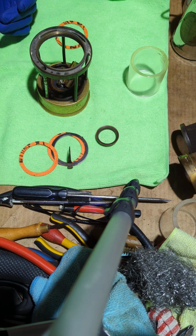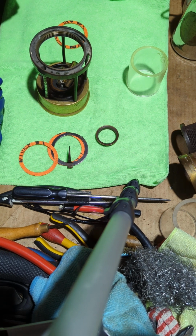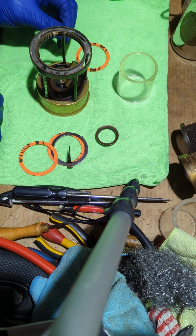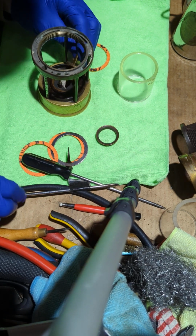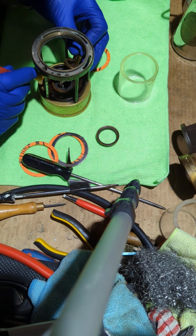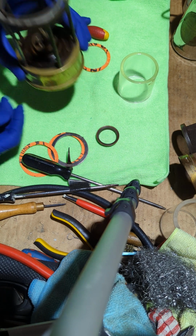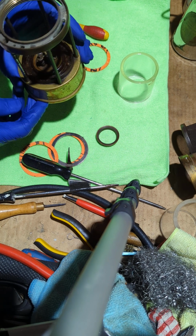It was a high tension current paraffin lamp, an oil burning lamp. It uses a flat wick and was lit in the lamp room with an electric current. It uses the standard protector washers and glass and the standard flat wick. So if you look into the aperture, you can see the flat wick going down into there, and you need to move it round and drop it onto the regulator screw, and you can see that screwing down, adjusting the wick.